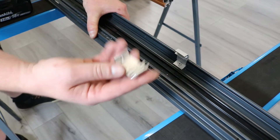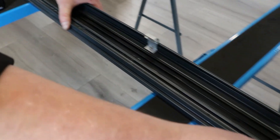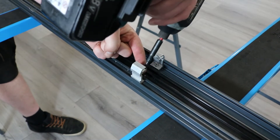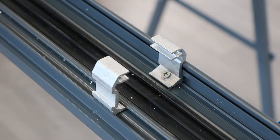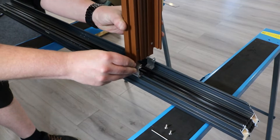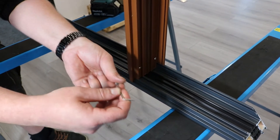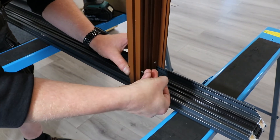For your non screw ported mullions, these sit on cleats. First of all mark your centre line, slide them in from the end and screw on with short 16 mil screws. Before assembling your frame make sure you attach your non screw ported mullions. These are attached with two screws to the bottom side of the mullion — these screws are provided by us. Use a 2.5 mil allen key.